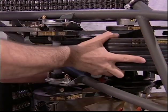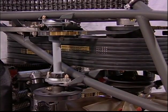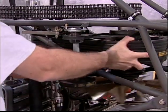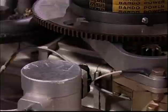The secondary can also be used to rotate the engine as shown here. Because the rocker box area is oily, use caution to prevent the oil in your hands from contaminating the belts and secondary pulley. Turning the secondary by hand for gross movement and using the flywheel tool for more precise movement is a good combination.